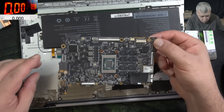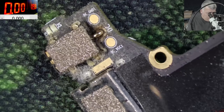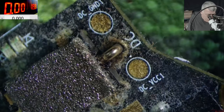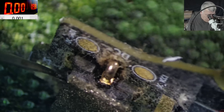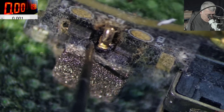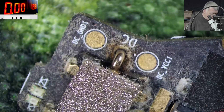The motherboard is out. Let's check together the charging port. Okay, that's making sense. You can spot the problem — the middle pin has no solder on the track, you can see here. This pin is moving all around — it's melted. Check here. So this pin is not broken — it's going inside. It got melted because there's no solder here. That's the issue, that's the problem. A lot of hair — let's clean it a little bit.